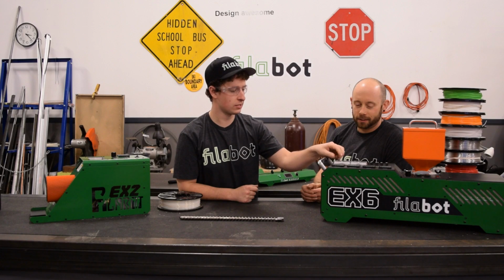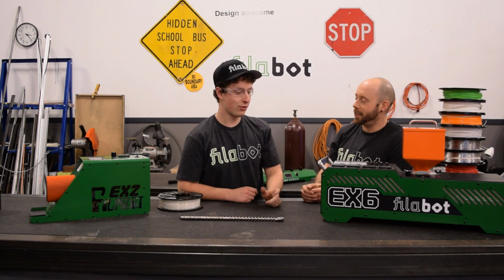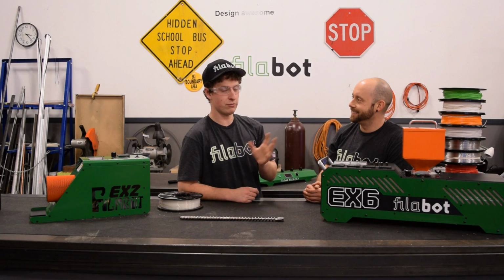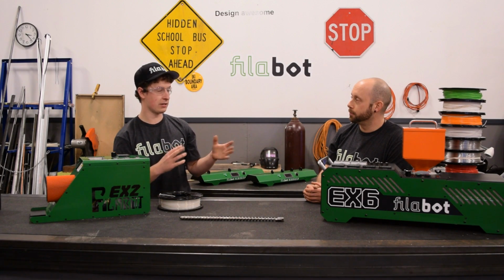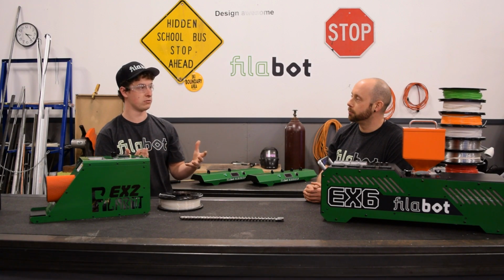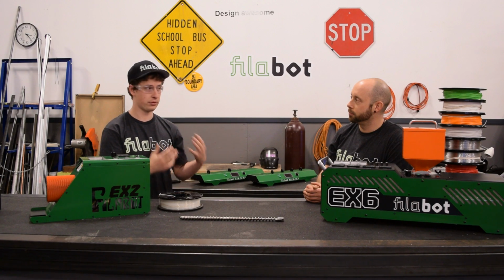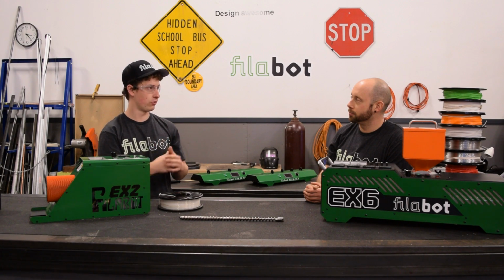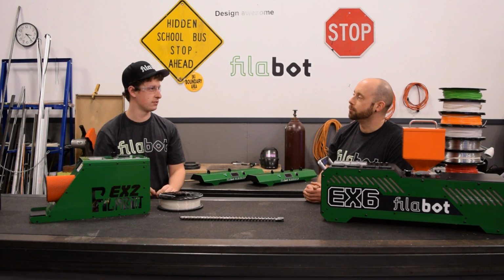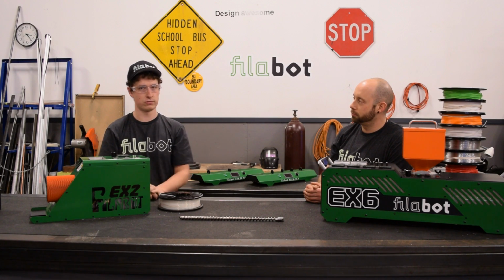One's a DC volt and one's a DC amps. I thought those were just there because they look cool. Well, analog gauges are a lot of fun. We actually went with analog because we can see the movement of the power going to the motor. What that does is allow you to troubleshoot whether your temperature is too low or too high, and just see what the issue is. They're older technology, but they're there because you can actually see it. Whereas if you just had a digital readout, you'd see number fluctuations that may not look like they're following a pattern. So super helpful.